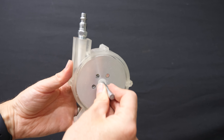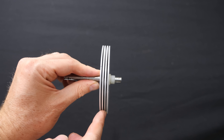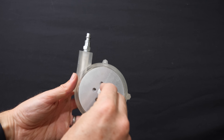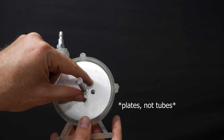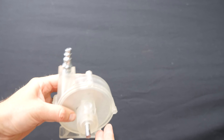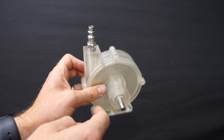Then we could just add a bunch more discs with a little space between them that's large enough for the fluid boundary layer to form. Now you have the Tesla turbine. The air comes in and goes around the discs and gets forced out the center.